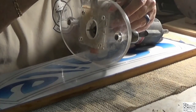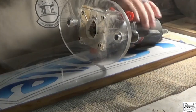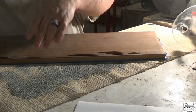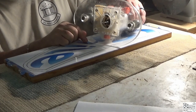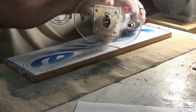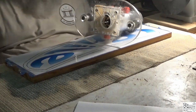I'm carving a different wood this time — it's pecky cypress. I chose a relatively clear section for this sign. It doesn't have too much peck in it. Peck meaning the bits of it that rotted out while it was underwater. This other side is relatively clear. How do you know how deep to cut? Well, I don't — I just eyeball it. For this one, everything's going to be the same depth, which is about what I've got right now. It looks to be either 3/16ths, maybe a little bit more — not quite a quarter, though.